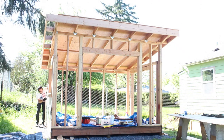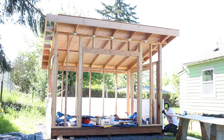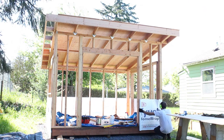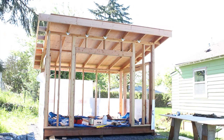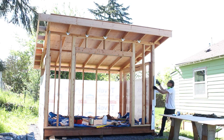The change of roofing materials brought up some questions that I needed to ask the guys at the roofing store, and it was Sunday. It was looking like I might need an air gap and/or radiant insulation barrier between the plywood and metal roofing, because condensation can build up between those layers and lead to mold.